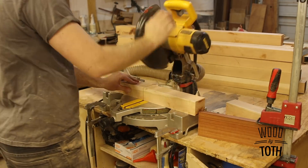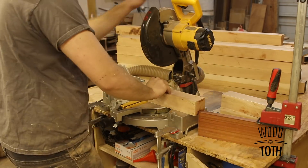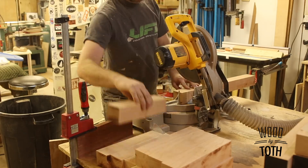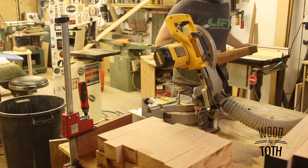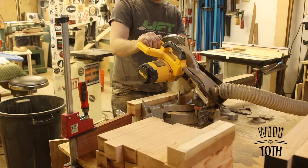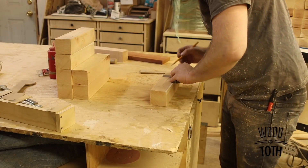The next step is cutting all of the long boards down into their final lengths. I do this with a chop saw and a stop block that I set up. The thing I make sure to do when I break down the lumber is make sure those cuts are square — if they are, I can take my board off the table saw, run it right up to my stop block, and make a cut without needing an initial squaring cut.